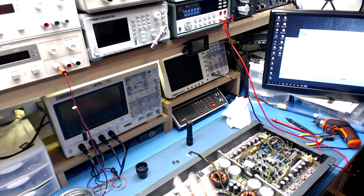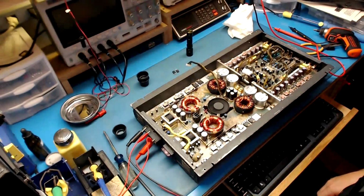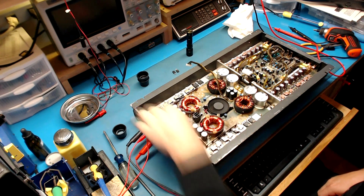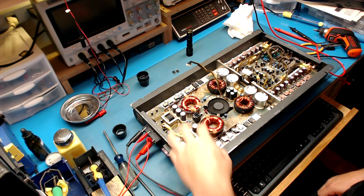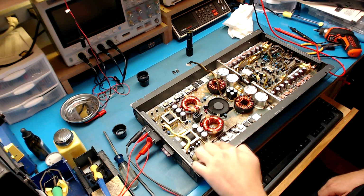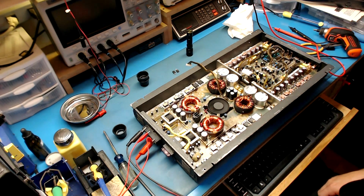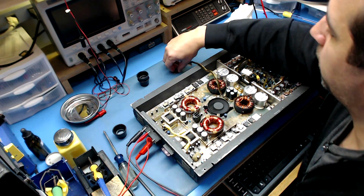But I'll be pulling the power supply board out anyway, because there are plenty of known problems with this amp board. There are traces that snap in the power rail section, and the LED drivers usually suffer some damage. And like I said, there's been some previous damage to these FETs before, so this is no guarantee that this power supply is 100% functional, but I feel confident enough that we can move on to the amplifier section to start troubleshooting why these components are removed.